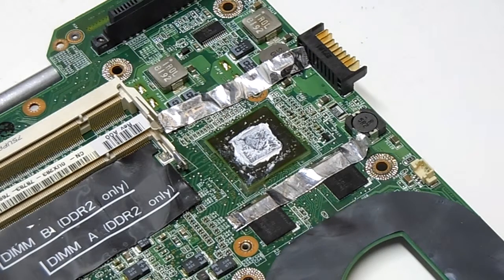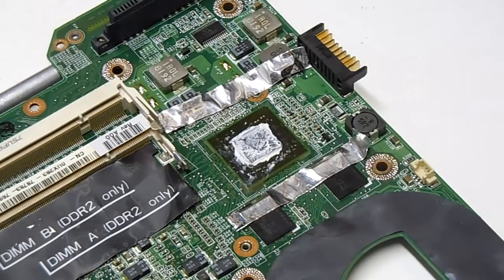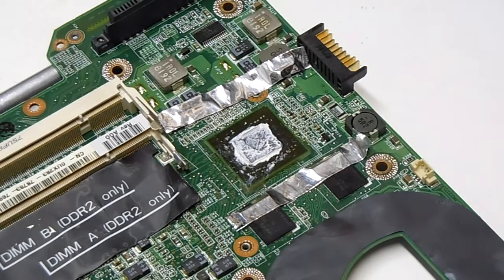After this is done it should be reflowed. Put it back together — don't reassemble the laptop all the way — and check if you've succeeded in properly reflowing the chip. If it doesn't work the first time you can reheat it again at a slightly higher temperature, but be careful because at a certain point you can do more damage than good. It's not something you want to do if you have a lot of money or vested interest in the product, because they really aren't designed to be fixed this way. When they send it to a factory they have real equipment designed specifically for this. So I wish you luck if you're proceeding with this process, and thanks for watching.